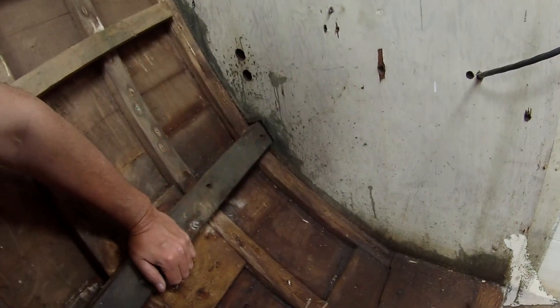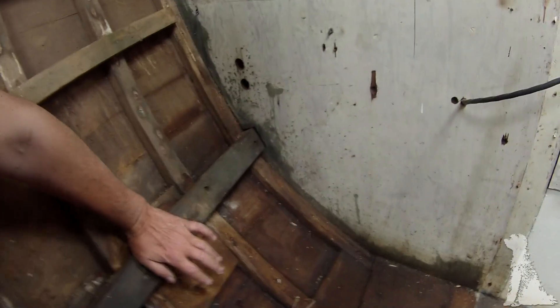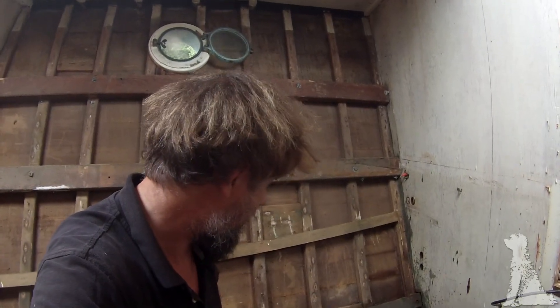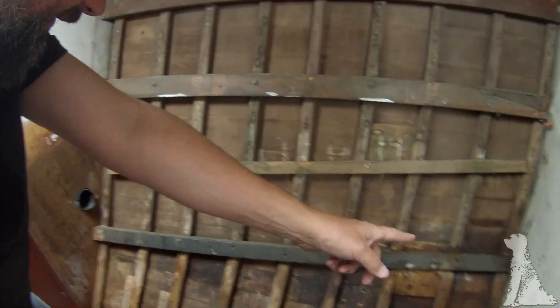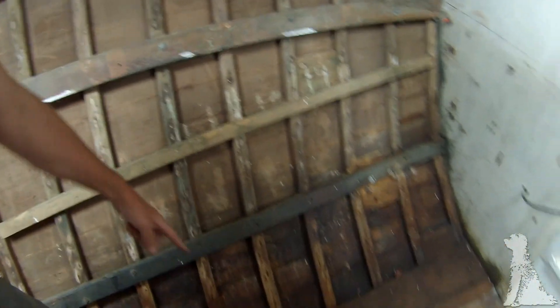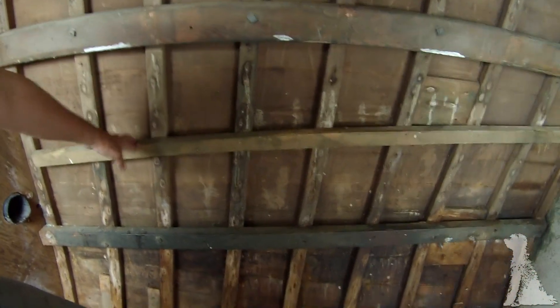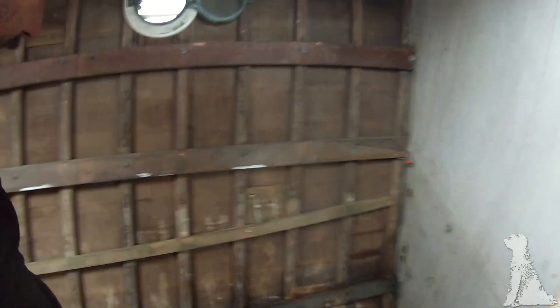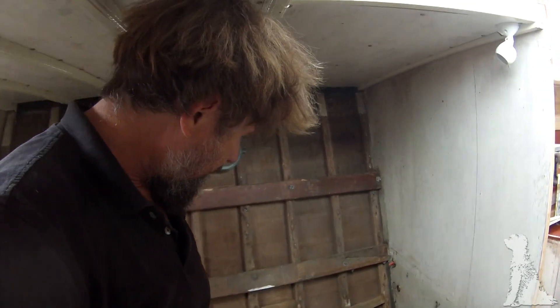Simply putting a sister in here isn't going to solve the problem - I'm going to have to do something a little more severe eventually. I'm not going to worry about it right now because the boat's in the water. Anything I build in here has to be able to come out easily and quickly so that at the next haul-out I can do some work in here. I'll have to sister basically all these ribs from about this stringer down, pull the sole up down probably to the keel, and fasten them from the outside. Not too daunting but not ideal.